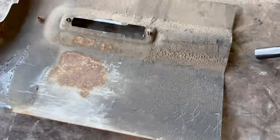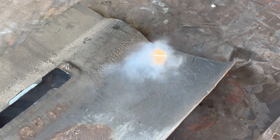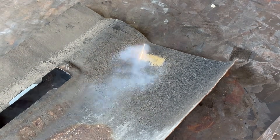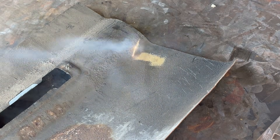On the back side of this panel it's covered with some kind of rust preventer or undercoating. I'm keeping the same settings: 100% power, rectangle 2 mode, 500 frequency, 12,000 speed, 500 pulse, and 20mm width and height.